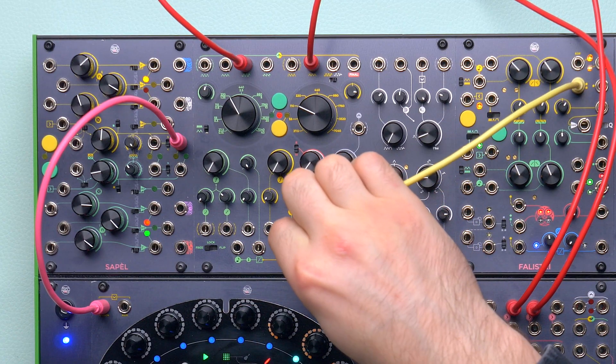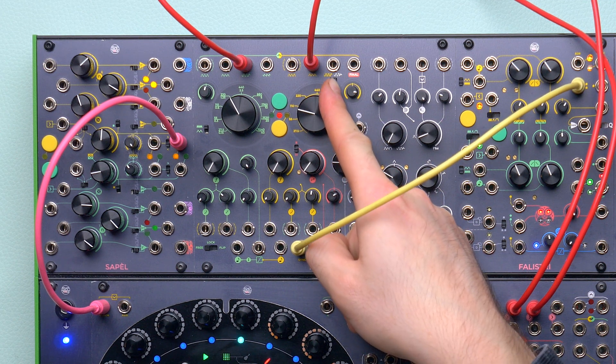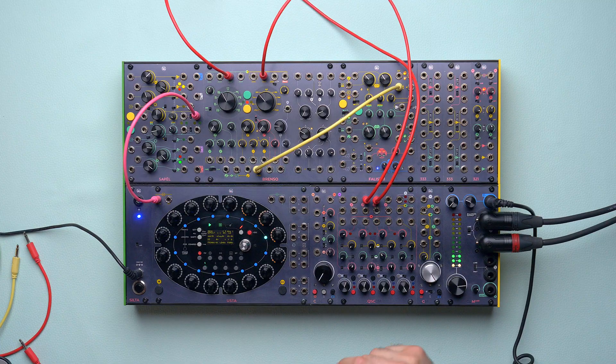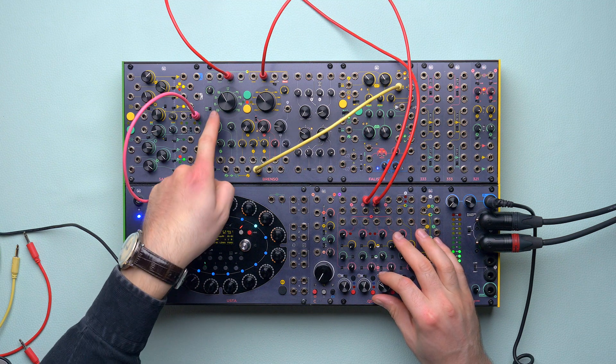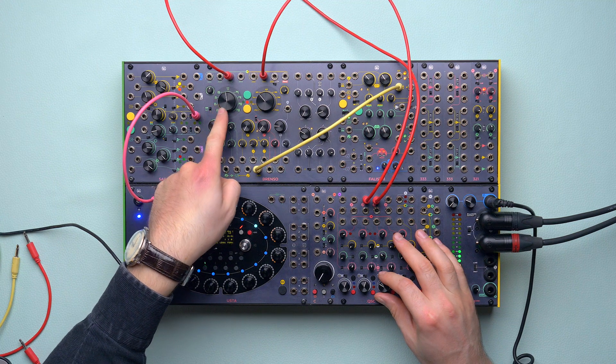The second thing is the yellow sync input. If we patch any sound to this input, it will immediately force the yellow oscillator to flip sync or lock sync — we can choose its behavior via a jumper on the PCB. If we want to be very experimental, we can flip sync the yellow oscillator to an external source and flip the green oscillator to the yellow one, but the sounds here are really wild.